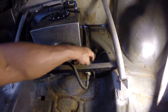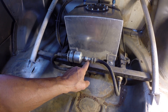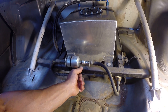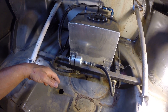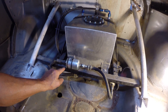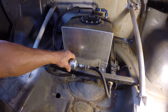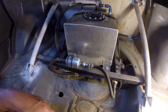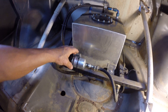If you look closely, you'll see a little piece of black plastic here. This is what racers call 'racer's plastic' — you buy it two feet wide by the foot. I heated it up a little and bent it around the tubing so there's no metal-to-metal contact with the fuel filter. Over time it won't rub through — this is a sacrificial piece underneath here, secured with zip ties.